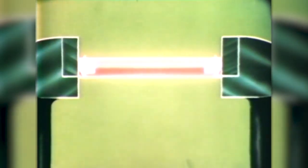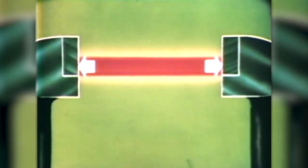Let's start with this ordinary steel bar. If the bar is heated thoroughly and uniformly throughout its entire volume, considerable expansion in all directions will take place. Now, if the bar is allowed to cool evenly without restraint of any kind, we know that it will contract to its original shape and size without distortion. However, if we place the two ends of the bar in a vice and then heat the bar uniformly, expansion in these directions will be prevented by the vice, and expansion can only occur in these other directions.